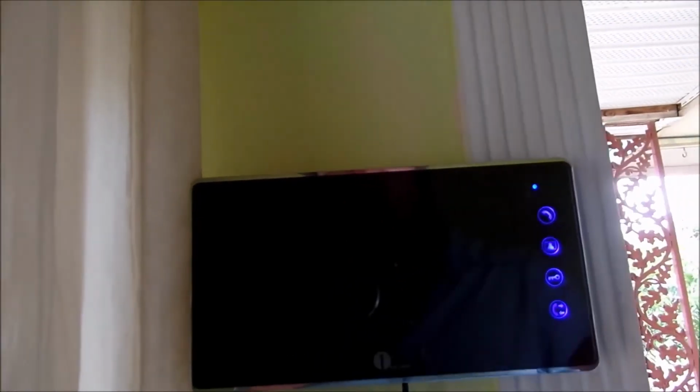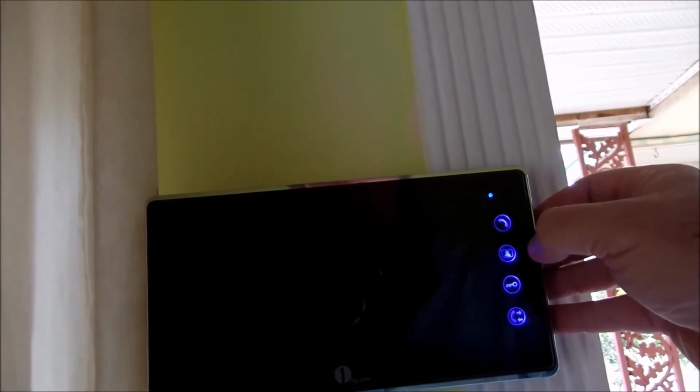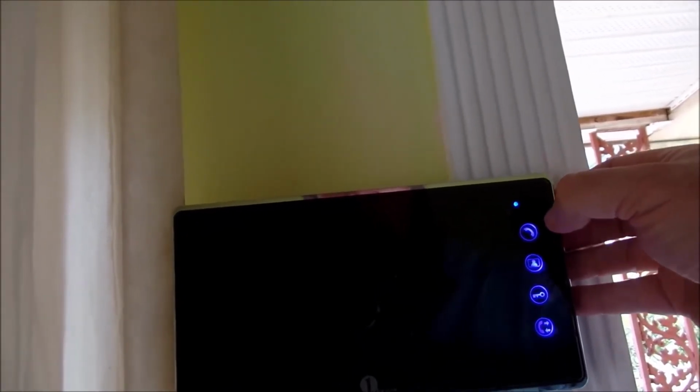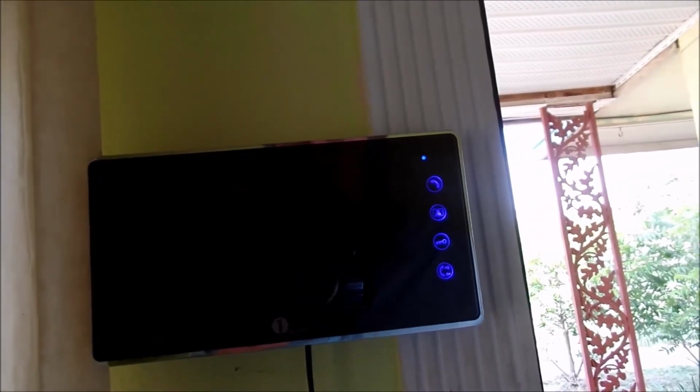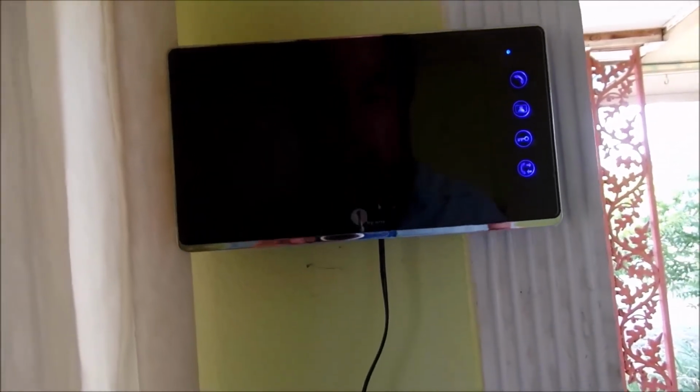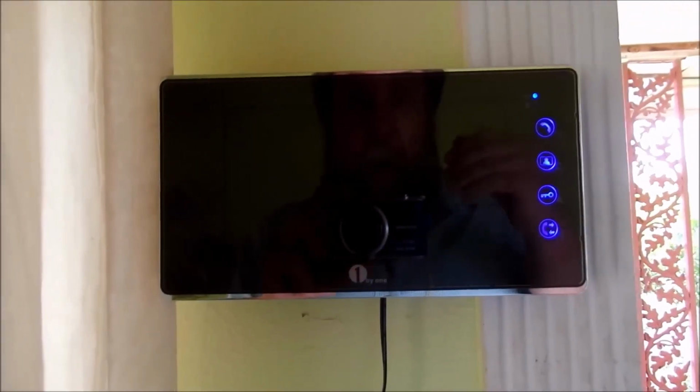So you don't want the screen to come on while you're doing this adjustment. So you're holding the monitor button down until it makes noise. Then you're pressing the talk button multiple times. And there's 4 different volume levels that you can work with. And then once you've gotten what you want, then you lock it into place again with that. It is not much harder than that to be able to make this work. Okay? Now, I'm going to show it to my parents, explain the features to them, and show them how it functions.